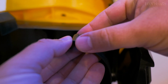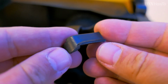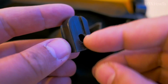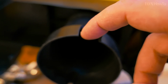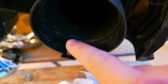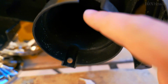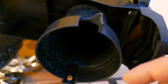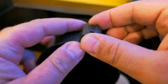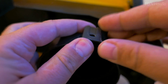There is a specific way to do this welding with the soldering iron on the plastic to make the bond stronger. And adding the filling material is also important, because you see this plastic is not very thick, the original one. And I don't really care about how it looks. I want it to be as strong as possible, even stronger than the original. And it is possible to make it stronger than the original, because you are making it thicker. The more plastic you add, the stronger it gets.